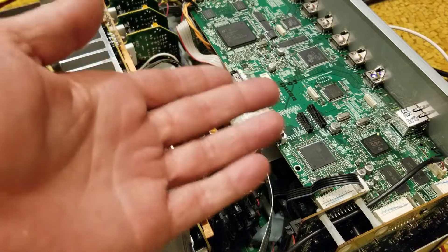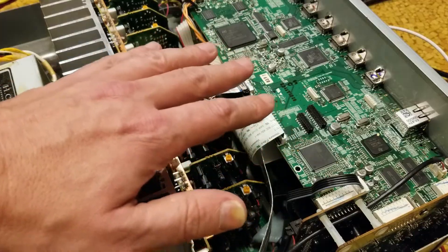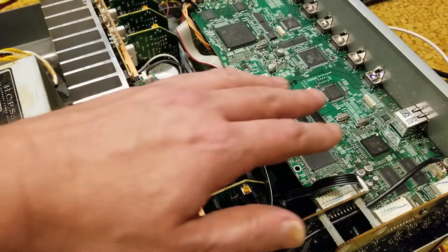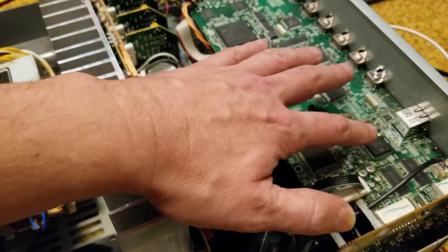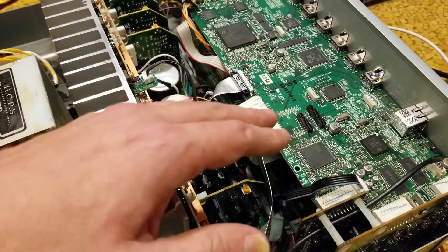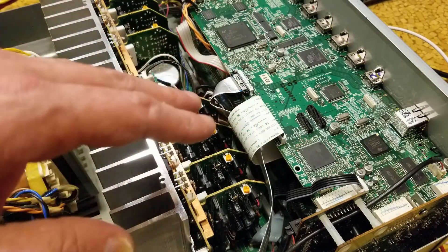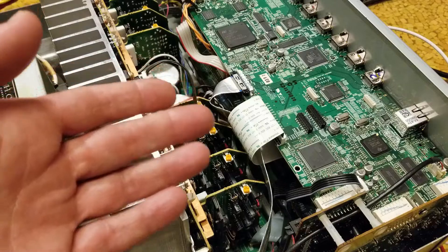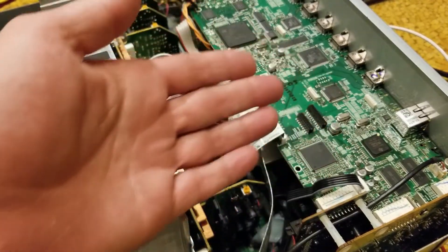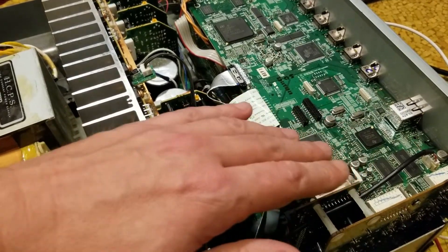Anyway, this has been a long video, but it was kind of an experiment and I'm glad it worked out. Even though I had trouble with a connector, we do know the source of the issue on this one. An electronics shop is probably going to charge a lot of money to desolder and re-solder both of those chips. I'm just going to hold out and use this heating method — it seemed to work, and I wanted to make this video for my subscribers and for anybody looking up the infamous Onkyo no-sound bad chip issue. This is another video showing the heat trick worked, but you really have to get it to the right temperature without burning up the processor.